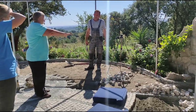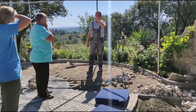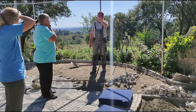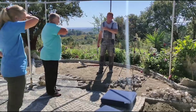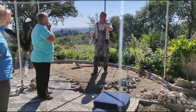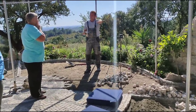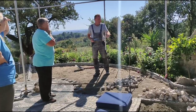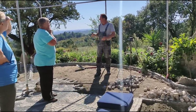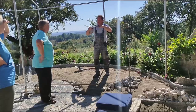I put the brita down, so that's fine. Brita's fine, yeah. But not that much if you put in brita, because mine's on a gravel, a granite. Yeah, I know. You can put gravel because gravel is non-compactable. If you level stuff off with gravel, it's not going to compact. If you level stuff off with sand or with soil, it compacts, and then if you put a hard surface over the top of that, it'll crack.